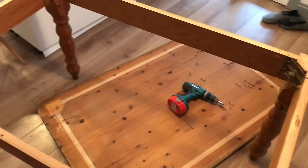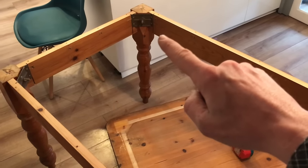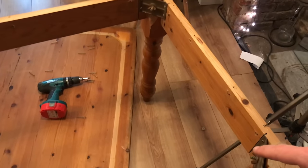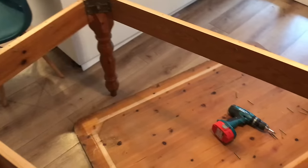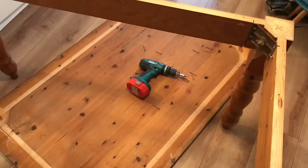So with those screws out, the table top comes off and this is going to allow me to batten round using maybe some 2x1 timbers — whatever I've got lurking around upstairs — to the side of the frame. I'm just going to use some little self-tapping wood screws, much similar to the ones that held down the table top in the first place.